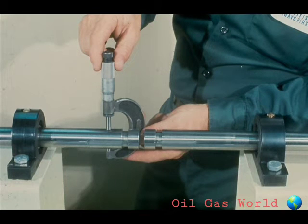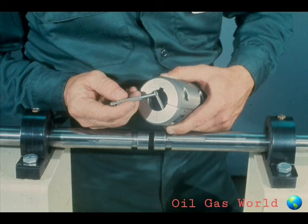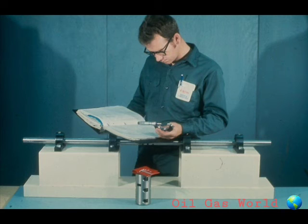To do this, measure the outside diameter of the coupling fit on the shaft with an outside micrometer. Then measure the inside diameter of the coupling. The coupling bore should be slightly smaller than the OD of the shaft. Since these measurements may vary somewhat, it will be best to check the specifications or requirements for the installation you are working with. There are many cases where it is necessary to bore the coupling halves to blueprint specifications.